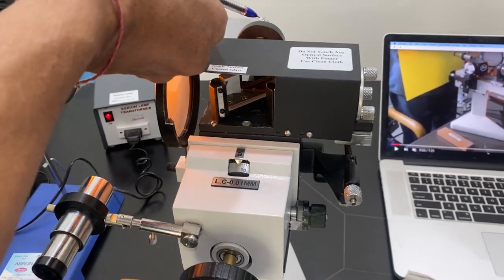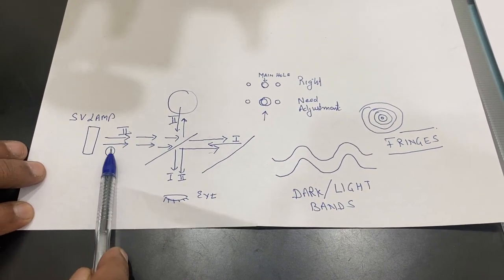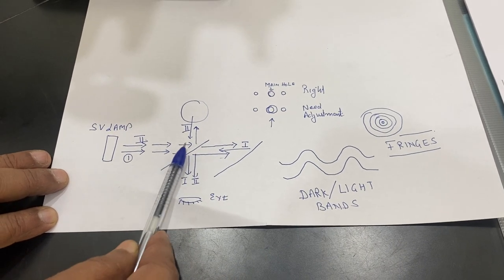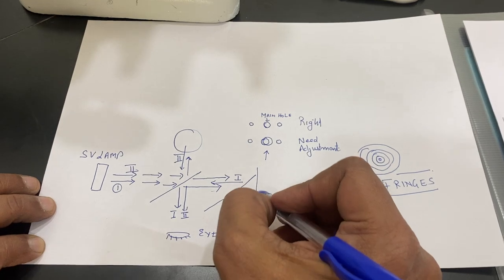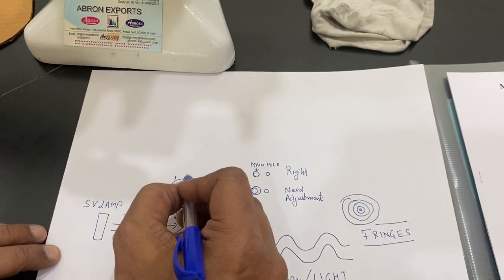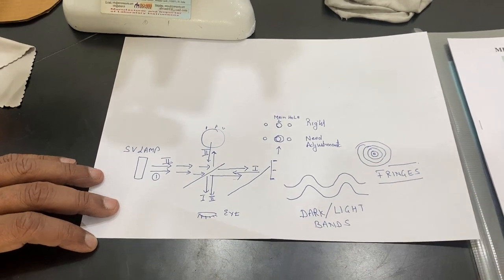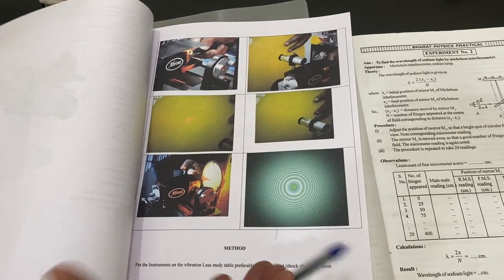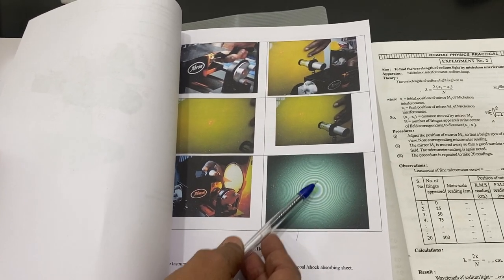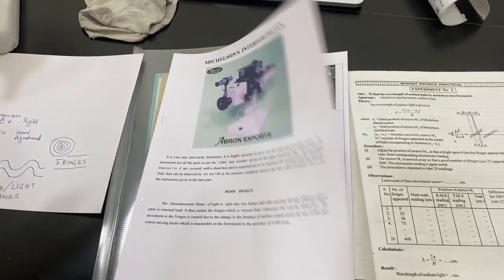There is a semi-transparent membrane — a surface-coated semi-permeable element where some light will pass and some will be reflected toward the other mirror. The sodium vapor lamp gives out light. Taking two rays: one goes from the glass to this mirror and comes back; the second passes through and goes to another mirror. There are three screws for adjusting so that they become parallel. Both rays will produce fringes — light and dark bands alternating, as seen in this actual photograph from our instrument.